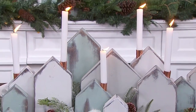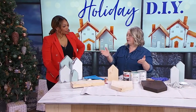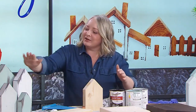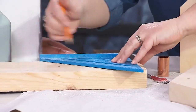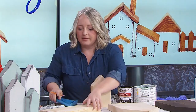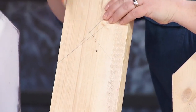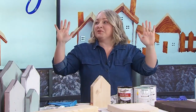I did a little drill bit in there for the candle holders. To get the peak, if you have a compound miter saw that cuts on a 45, you're golden. If you don't but you've got a speed square, all you need to do is mark a couple of straight lines on either side and then use a skill saw or circular saw to cut out your peaks. That's literally the only cutting you need to do.